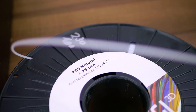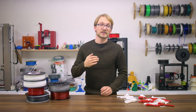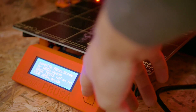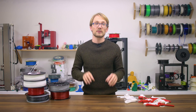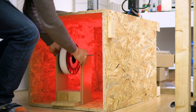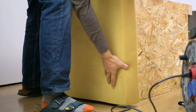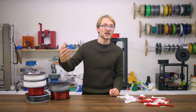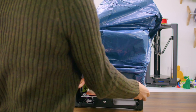So I ran a few more tests on the InnoFill 3D Natural ABS. I bumped up the temperature to 240 degrees, as you all suggested, though I'd personally have lowered the temperature given all the curling I was already seeing. I re-ran the strength tests in open air, in an enclosed chamber, and in the enclosed chamber plus a part cooling fan at a fixed 20% setting. The chamber I'm using here is just a shipping crate the Dynamo 3D One Pro came in, and with the printer's heated bed going and the cracks sealed off as well as I can, it reaches 32 to 35 degrees in there, which already has quite an impact. If you don't want to commit to building a chamber around your 3D printer, you could also just grab a trash bag or two and plop that over your printer — that should already be enough to have it heat up to where ABS will work much, much better.